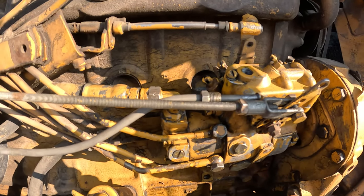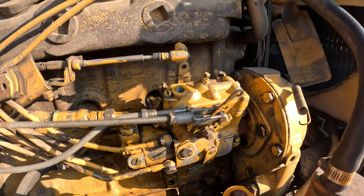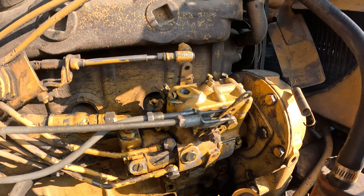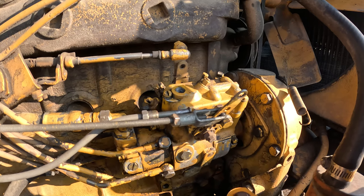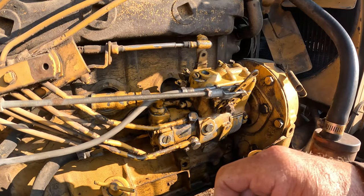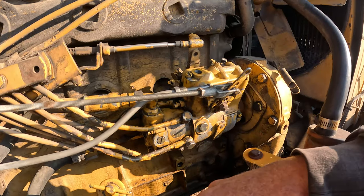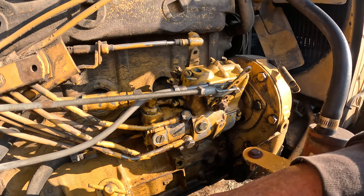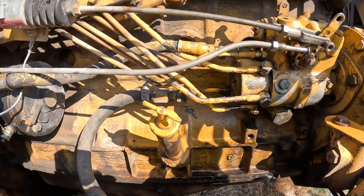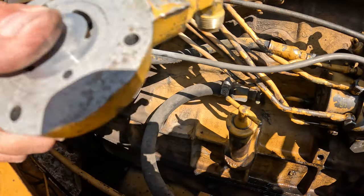I'm back out here at it today. I told Jake if I can't get this to work I'm giving up, and he says no you won't, you never give up - that kid knows me too well. I can turn on the pump and I'm not getting any free flow of fuel out the return even with the check valve removed. My understanding is there's a passageway up in there - these are self-bleeding, so if you've got supply pressure to the vane pump there's a passage that will push all the air out and come out here. I'm just not getting anything through there, so something's wrong.